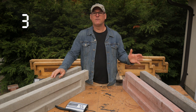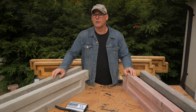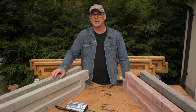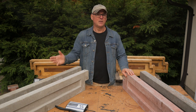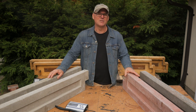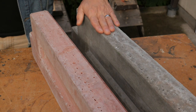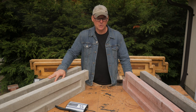The panels weighed on average 34 percent lighter than regular concrete, which was a bit lighter than the similar vermiculite panels from Part 3. The CSA perlite panel was 45 percent lighter. Since CSA concrete is stronger than Portland, I was able to use more perlite in the mix. The drawback is that CSA cement is more expensive and sometimes harder to find, and the Portland ones appear to be strong enough and light enough. The colors worked well and blended evenly. I think I could have used less of the red as it came out deeper than I expected. The black looks pretty good though and I'd use that again, maybe even more. I'm happy with perlite — it makes a light, strong, and durable panel for these garden boxes. I wouldn't hesitate putting them in my garden if weight was an issue.